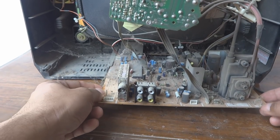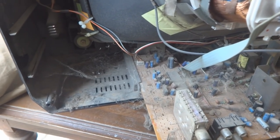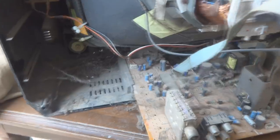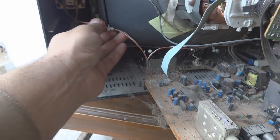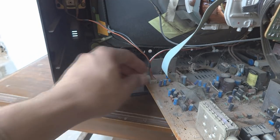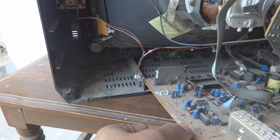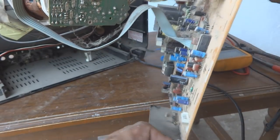So, what is bad with this one we will now see. First we will make a visual inspection. While making the visual inspection, it looks okay. The switches are pressing — I can hear them and I can see them. So we are going to remove this chassis. For this purpose we have to remove some cables — here is the speaker cable. We will also remove this plug, and we should keep in mind what we remove so we can fix them back the same way. The chassis has been removed.